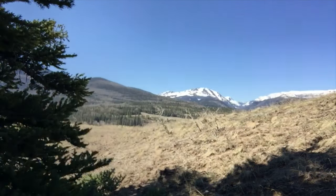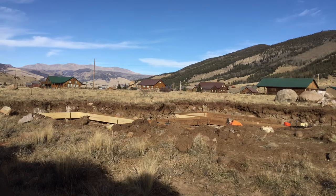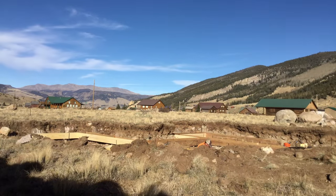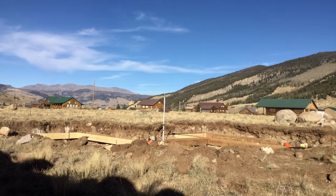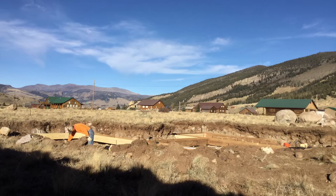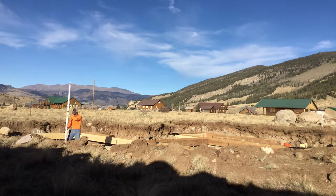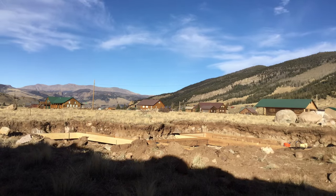Concrete work is a young man's game and most often it's a team sport, but when you're building out here in the middle of nowhere, it's up to you to get it done. Here I am building the forms for my footings solo. The way I do that is I'm holding a surveyor's rod for setting the grade, my foot is stepping on a flat bar to raise up the form, and then I'm screwing it in to the stake at height. Sometimes I like to go a little bit higher and then knock it back down with a hammer later.